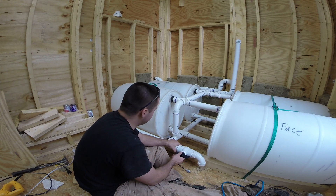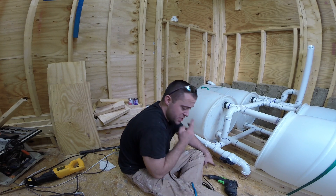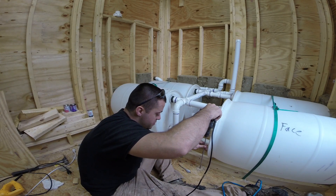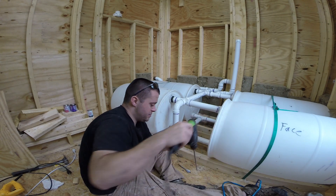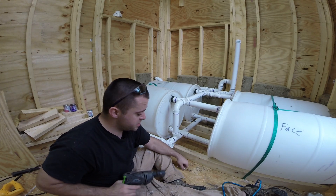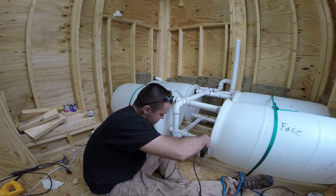So I made a mark and marked it out. I'm in between the joists here, and I know I have a steel beam running right here, so there should be no obstructions. I'm going to take a long drill bit and get a center mark so I know where to cut it when I go underneath the trailer. Since I've got to cut this with a jigsaw, I won't be able to get up tight there, so I'm going to do a couple large holes right there.